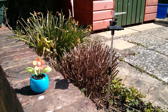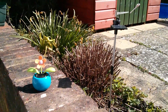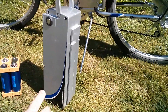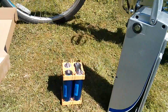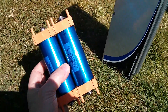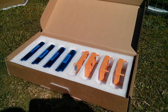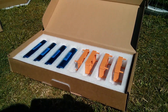Let's have a little review of all the projects I've got on the go — there are quite a few — and some of the changes I'm planning to make this season. The first project is the electric bike. This project is to replace the lead acid gel cells in this battery pack with lithium iron phosphate. I've made up one replacement pack here. Four 3.2-volt cells gives you 12.8 volts. The other four cells are still in their box, but that'll produce nominally 25.6 volts.